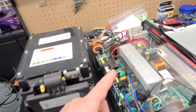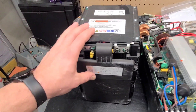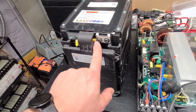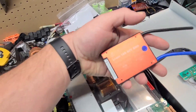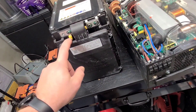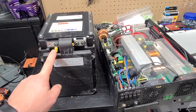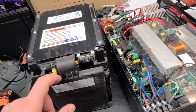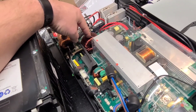I also wanted to talk about why this wasn't a catastrophic failure. The inverter is dead, but these are the batteries I was using in there. Each one of these has a DALY BMS that I put in, rated at 40 amps. I have them connected in parallel so I should be able to get 80 amps total. That farting noise the guys were hearing — that was the BMS shutting off. They were overloaded and shut off. As soon as I turned that switch on, it shorted out and the BMSs were overloaded and shut off.